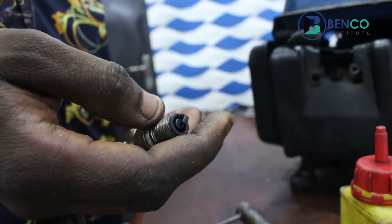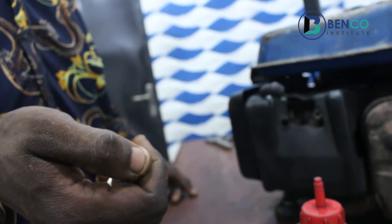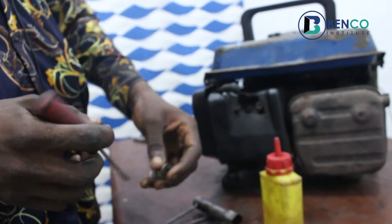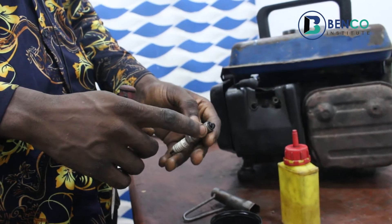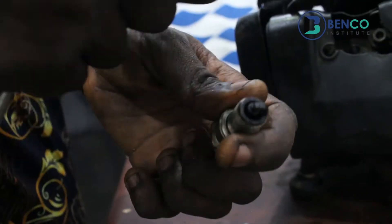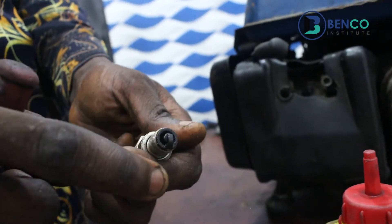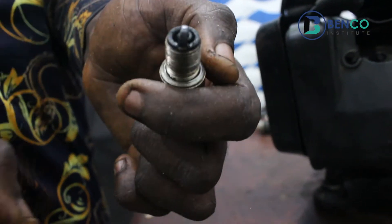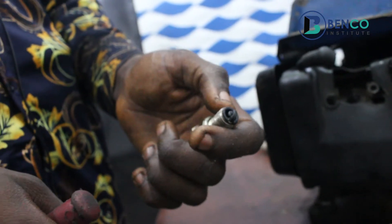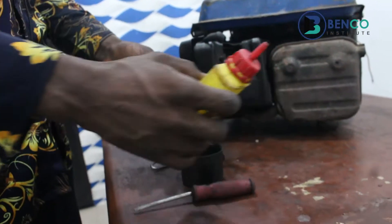Let's say you have a generator at home and you need to wash your plug — perhaps it's time for servicing and there's no technician around. What do you do? You get a flat screwdriver. Originally, what we usually use for something like this is what we call an iron brush. We just have to brush these two electrodes — the central electrode and the other electrode.